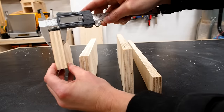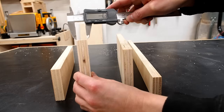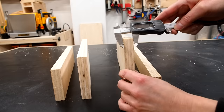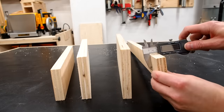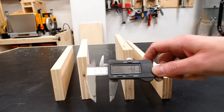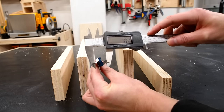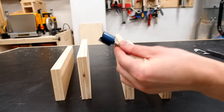It's close, but as you can see, this one is actually pretty close, this one is actually bigger than three-quarters, and these last two are way under — I have a lot of wiggle room. These ones are actually closer to about 23/32nds, and that's probably why they actually sell undersized plywood bits like this one that are 23/32nds. So this bit works great when your plywood is actually that dimension, but that clearly isn't always the case.